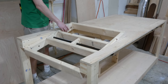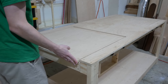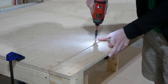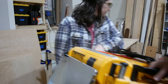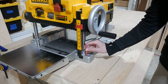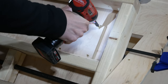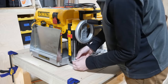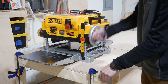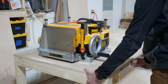I flipped the top over so the workbench side was down and cut out two more plywood squares for the tool mounting sides of the rotating tops on the table saw. I countersunk holes and drove in longer screws to hold it in place, as this plywood will have a lot of weight attached to it. I had Mrs. Bill help me lift the planer on top — that thing is heavy. I marked the mounting holes for the planer, drilled through the top, added plywood squares to the bottom to reinforce the mounting points, dropped in the mounting bolts from the top, and tightened the stop nut from underneath. Before flipping it back over, I lowered the planer down to conserve space and lower the center of gravity to make it easier to flip, then loosened the locking knobs.